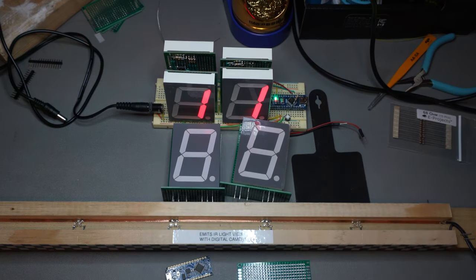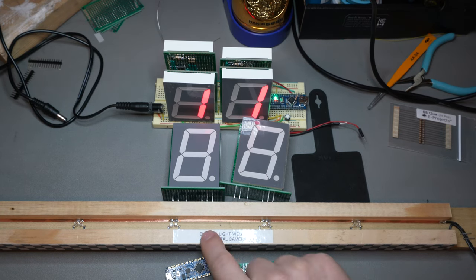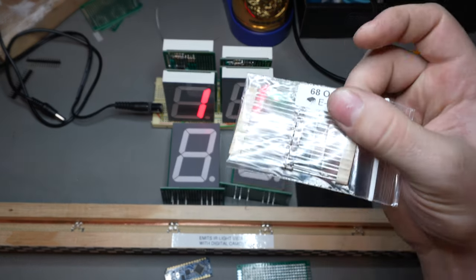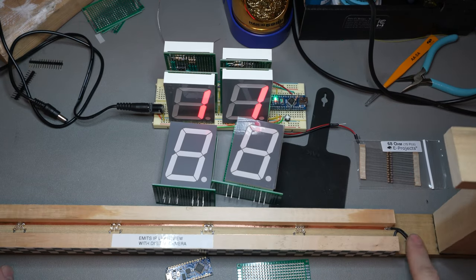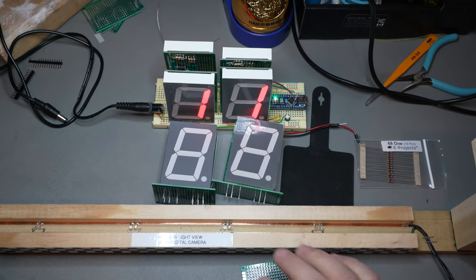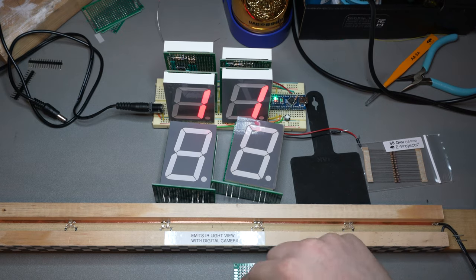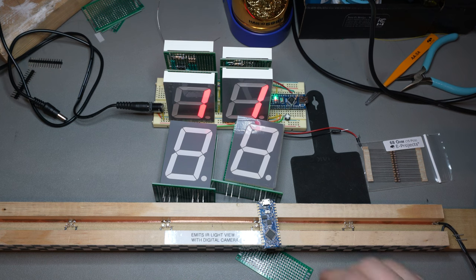And what it means we gotta do is each one of these resistors on each of these LEDs, I need to pull out the chip resistor and then put in one of these old school through-hole resistors. And then from there, we can just grab the end here and plug it onto the 5-volt rail here. And then everything should be fine. Nothing should blow up. And it should just run when we plug in 12 volts into this whole system. So hopefully that makes sense.